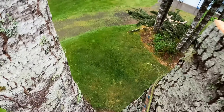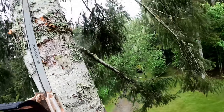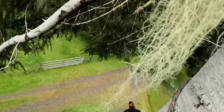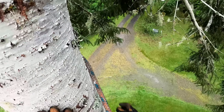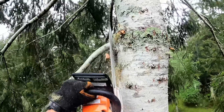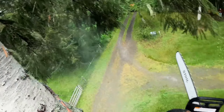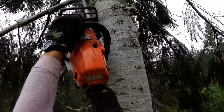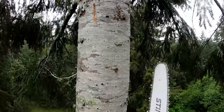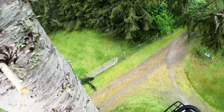Let's get this other stem down. We're gonna try and put this one right into the road. I can tell the lean is right on this fence, so we're gonna try and bring it over here to the right. Stop your chain every time you're cutting — take some limbs or whatever, you're bringing the saw back — stop your chain. Get our angle cut in first.